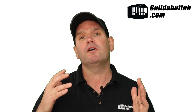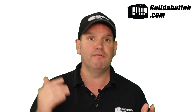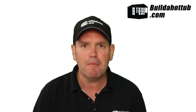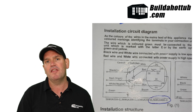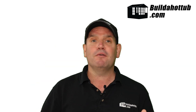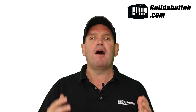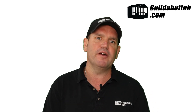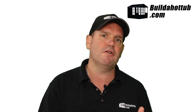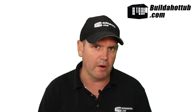I keep stressing this because I've seen so many people do it and it can be problematic. For example, when you are wiring up your pump, if you've got a dual speed pump, you're looking for those four different pinouts: high speed live, low speed live, ground, and common. Over on your pump, you will have four connectors that you're going to match up to those pinouts. You're not going to rely on the colours. You're going to look at a pump circuit diagram — that will look something like this — and it will tell you which of the connectors you're going to connect each one of those four wires to. Hopefully this video will help clear this up because I've had so many customers and non-customers alike make this mistake, try to copy colours, and wonder why things just aren't working how they should be.